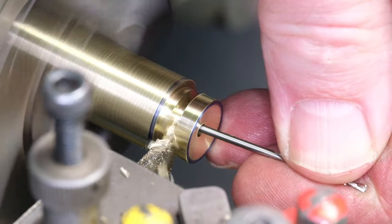Before we can make the suspension spring, we need to straighten out the back cock pendulum support. You can see that the slot has been squeezed together at some point and closed up to fit probably an off-the-peg commercial suspension spring. So we make these arms parallel again, and then check that with a gauge pin, or in this case, the shank of a twist drill.